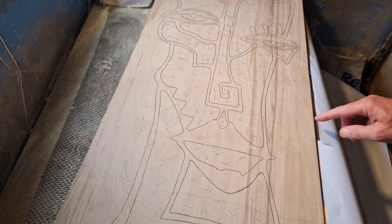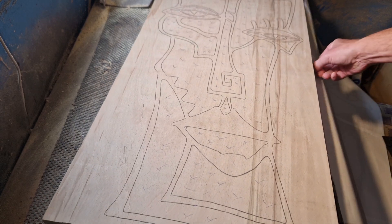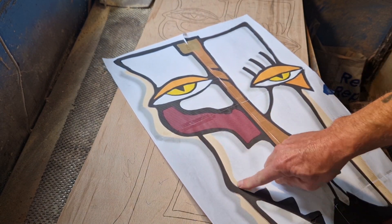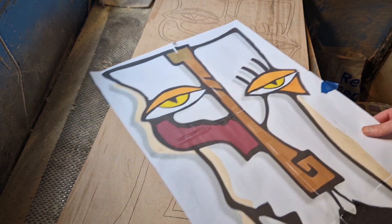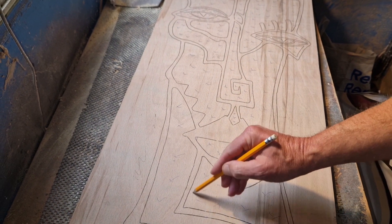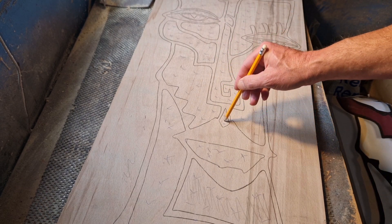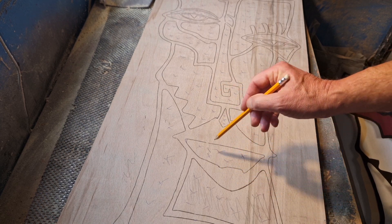Just take this bit of tape off the sides. Remember, you can use this template over and over again. I've seen people just glue the paper straight to the wood and route over the top — you might get away with it on this one because there's nothing too complicated. For me personally, carbon and trace is the way. Now normally I would shade in the areas that we want to remove, but on this occasion I just put little crosses in to let us know these are the pieces we want to route out.